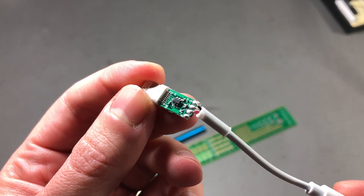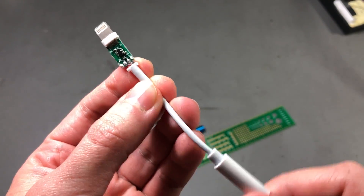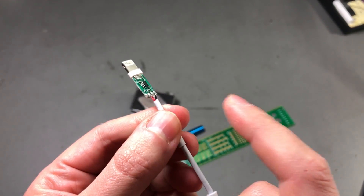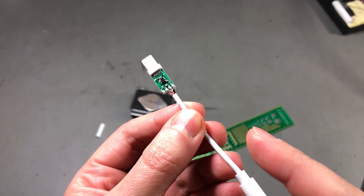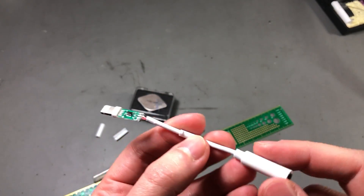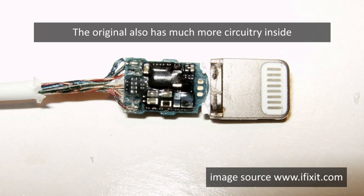We're also discovering new things in this teardown. Notice how we have just three wires going to the 3.5mm socket, which I believe contains nothing else — those are the left, right, and ground connections — but we don't have any microphone connection or switch connection. So this fake adapter will not work with the microphone, unlike the original adapter which I'm currently using to record audio with an external microphone. The original adapter has a much smaller PCB inside and up to seven wires going to the 3.5mm jack, supporting the microphone as well as the switches present on older headsets.